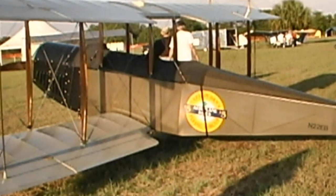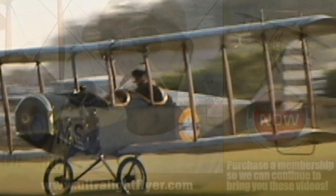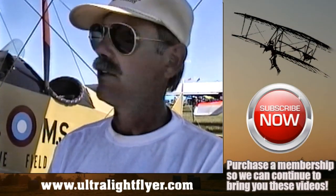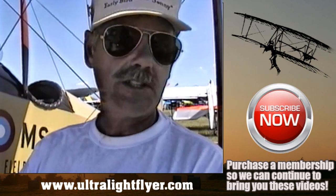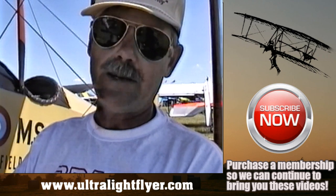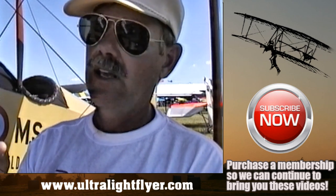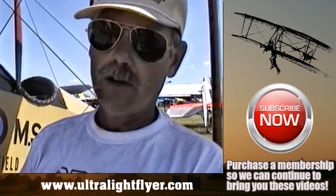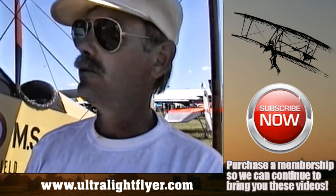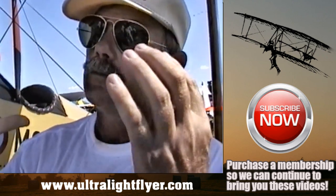The chrome moly steel doesn't crack. We've got an all-aluminum wing in here — you see every one of those fittings is a hinge fitting, so when you land, you don't get the stress on the wing tubes like you would on the fuselage. We build a pretty heavy fuselage; the chrome moly tube in there is the same size as on a SuperCub. We had one guy crash one so far — he stuffed it straight in, 400 feet, vertical — and he's walking around today. Didn't have a helmet on, didn't have a shoulder harness on, but the FAA said it was due to the fuselage and trajectory.